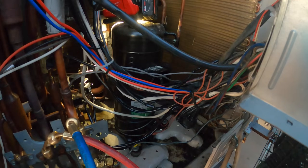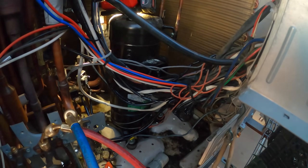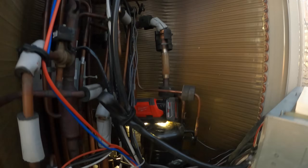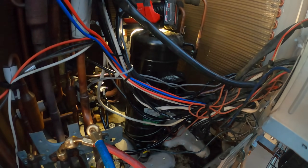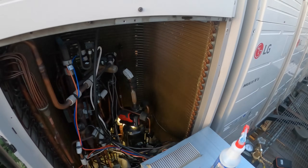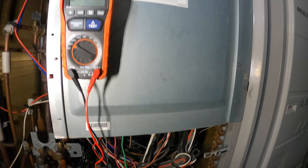There's so much oil on the floor — oil mixed with refrigerant has leaked out, and so much oil that was sitting in this coil is gone. Most likely we'll need to change that valve, and also probably the compressor. When you change the compressor you need the inverter board. Looking at this sensor over here, when it ran low on refrigerant part of it actually melted, so this thermistor could be bad as well. Just another day in paradise.